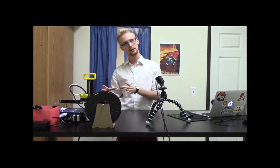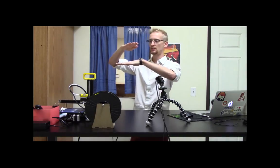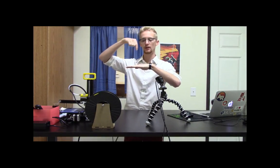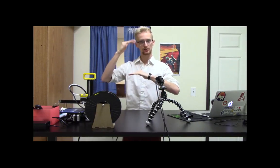What the slicer program is going to do for us is, whenever you export a file from a design program, you export it as an STL file, which is basically stereolithography. That creates a lot of triangles on the surface that you created, and those triangles are all connected by vertices and edges in order to create a shape in a 3D object. Whenever we export it, we need to put it into a slicer program, which is what Cura is. Cura changes the idea of triangles into a numerical control value language. It takes the object and cuts it into lots and lots of different layers. Those layers are then given coordinates for the printer to follow so it can print further and further up, making layers upon layers to create your 3D object from one filament.